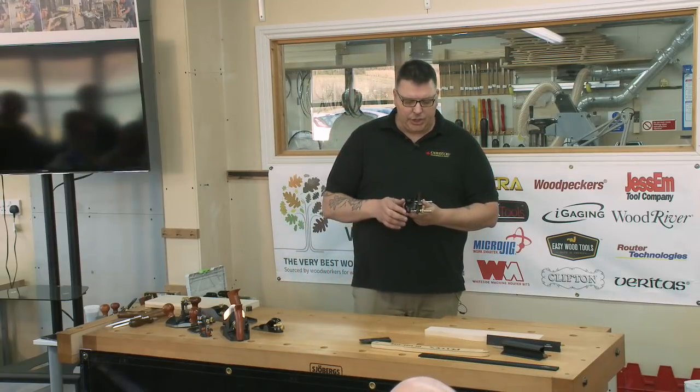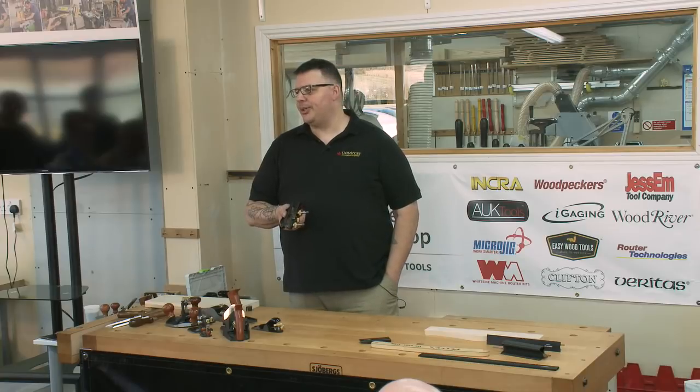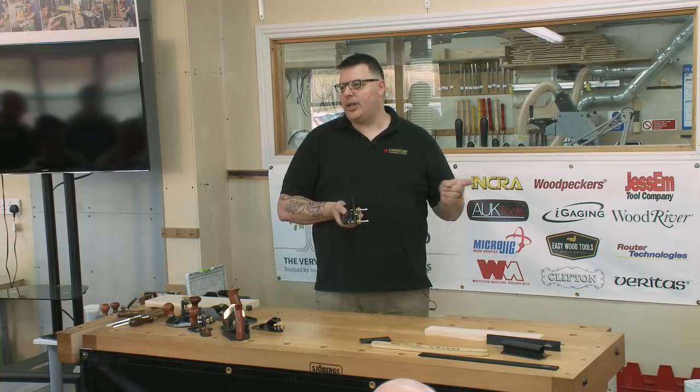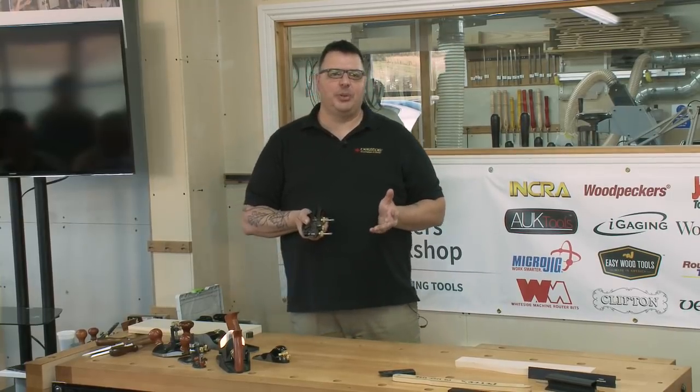which may sound convenient, but you just end up with a pile of stuff under the table, which isn't really probably what you're after. So a lot of times I work referentially as opposed to using numbers. And mainly that is because as soon as you get numbers involved with something, now you have the potential for error, right? Especially in North America, where we still are using the imperial method, you know, you start adding 1 1/8 to 3/32 and then a 16th. Right, you start adding all those together, you have to decide what the common denominator is, and then do all the addition, reduce the fraction if required. You know where I'm going, right? Millimeters is a little bit easier because it's base 10, right? If you can add and subtract, you have a reasonable chance of success.